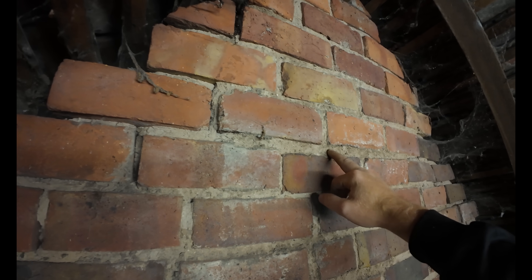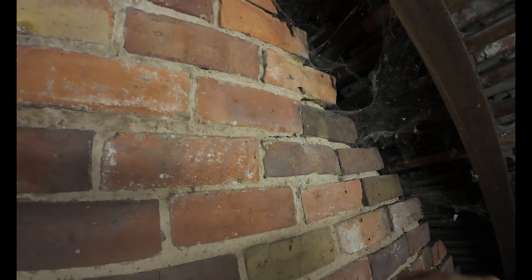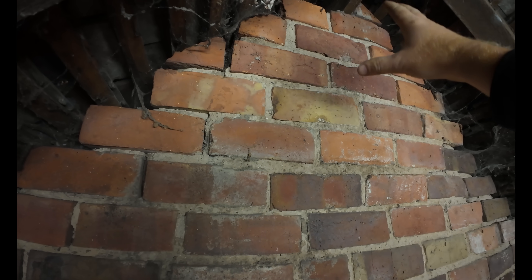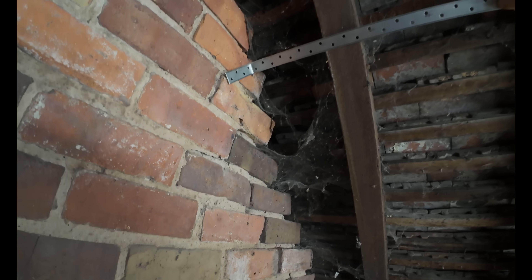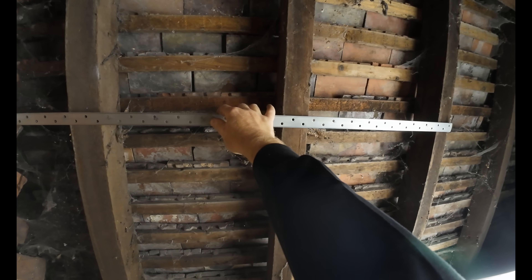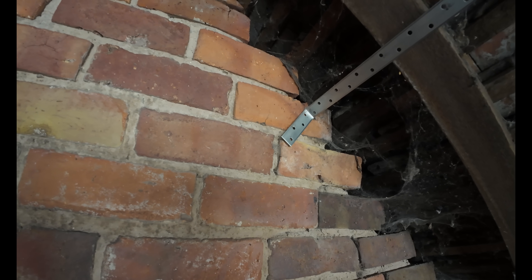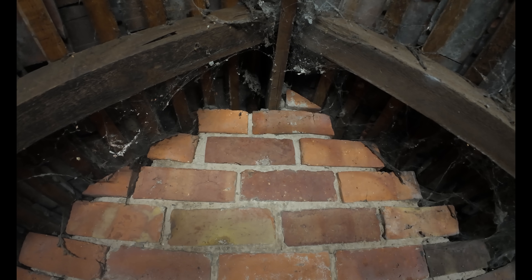There's a break in this wall - I can see the crack just here in the brickwork. This wall has gone slightly. The ridge, the top section ridge section, has stopped where it is. So we're going to put these stainless steel straps on here and they're going to be screwed back three rafters. We're going to resin fix them, drill some bigger holes in the end of them - some M12s - and resin fix them into the brickwork. We've got two on the ridge to do.